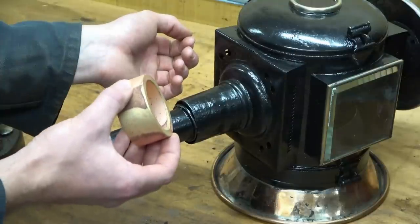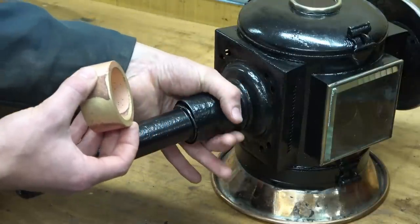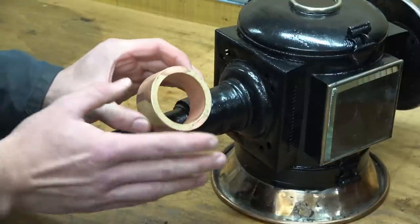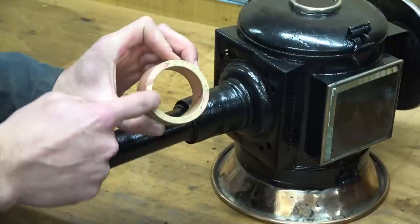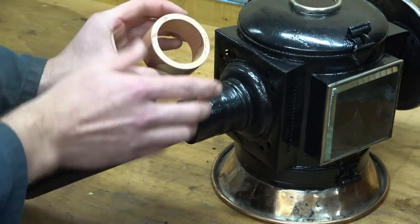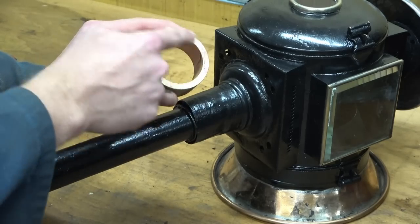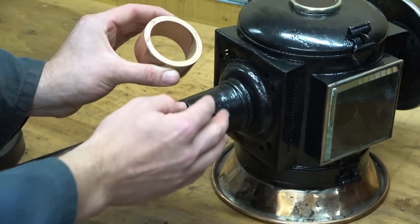I now turn to the experimental portion of this video, and somehow I have to make something fit round this oval. Now, what I have opted to do is to machine this annulus, and I have made the circumference of the internal bore equal in length to the distance round the oval. So in theory, if I can change the shape of this circle into an oval, the distance round the two should be the same, equaling the same size oval.